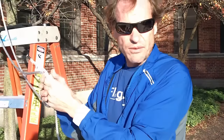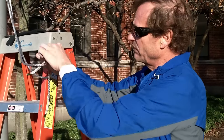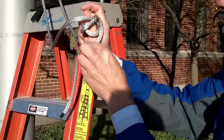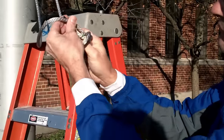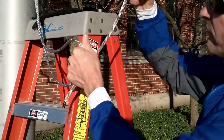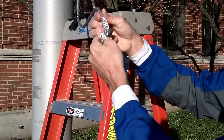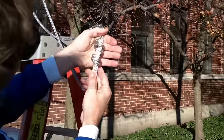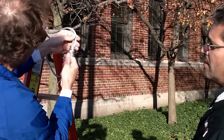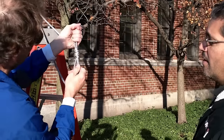We're just going to tie it. We have a special knot we use. We put the two ends opposing each other. We get some slack on each side and we wrap it around our thumb twice like that. Now we take this in and we go under our thumb, bring it up along and out to that end of the halyard. Then we simply go around and do the same thing on the other side — take the rabbit back through the rabbit hole. So we have two circles and the halyard going back up. When we bring this together it's going to get tight, so you just have two knots against each other and it will actually tighten itself.